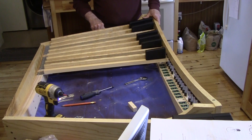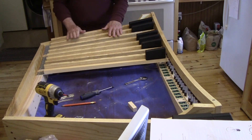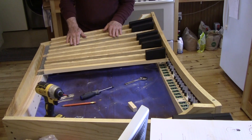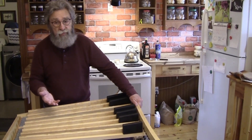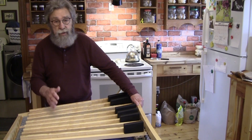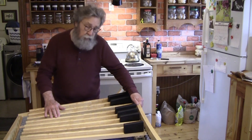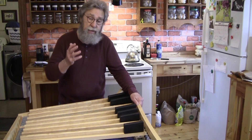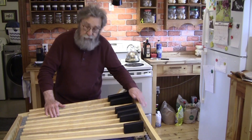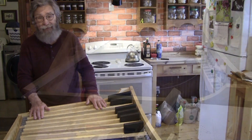We've discovered something really important: if the sensor is too far out, it won't release the note — it'll trigger the note but won't release it even when the pedal is all the way up. This is a good example of where it's worth getting your software set up before you start assembling your pedal boards, because the only way we could tell for sure was by listening through the speakers. Sometimes you really have to push the magnet fairly far into the underside of the pedal.